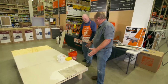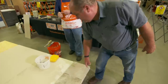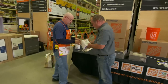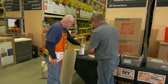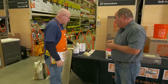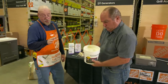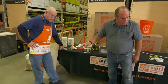Once all the tile is set, you can't grout right away — you have to let the adhesive set for at least 24 hours with no walking on it. Pull the spacers out when you're ready to grout the next day. Grouting is simple — mixed up similarly to thinset. We have sanded grout for larger grout lines, from one-eighth to a half inch, and non-sanded for thinner lines. Sanded grout has more bonding strength so it won't crack with a larger joint. There's also Fusion Pro — a pre-mixed product that needs no sealer.